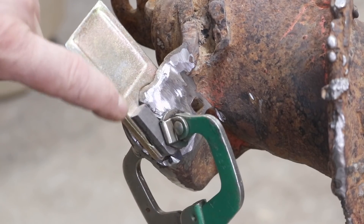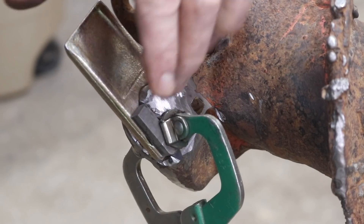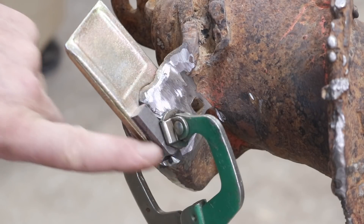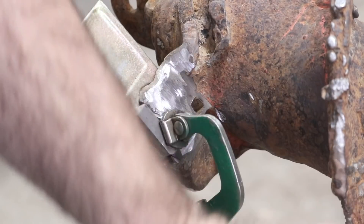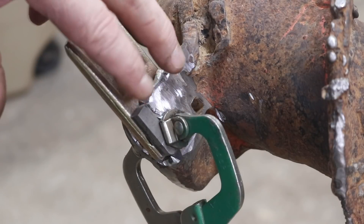I went with a little thicker and a little wider piece of key stock in here to fill this a little bit better, to bring this edge out even with the tooth. And then this will go on top of that. We'll tack this in and weld this in first, and then we'll put this other piece on.